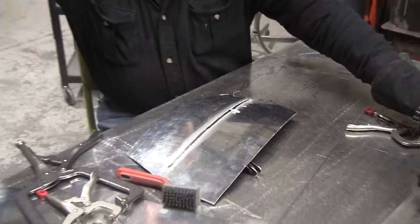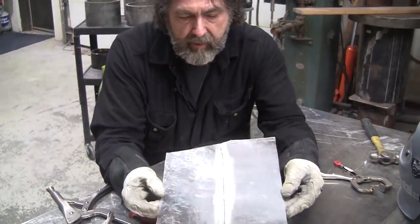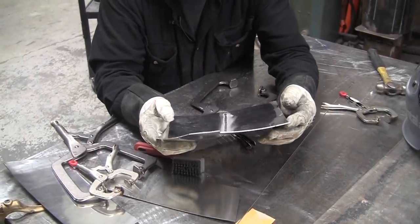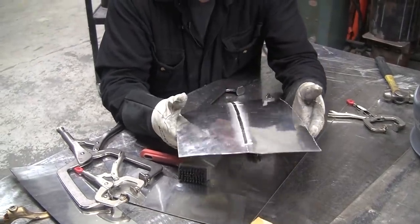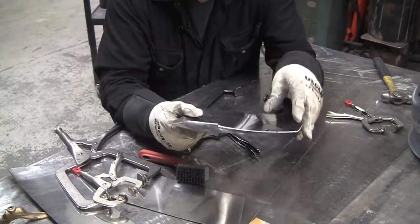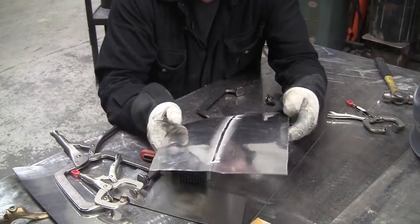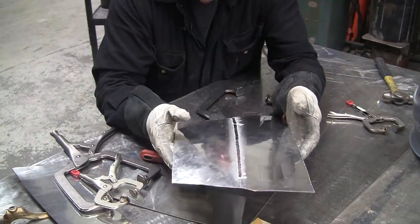There's the top side — no rod was added. We got a lot of drop-through on the back side. But if you look at the weld on the back side, the metal is shiny and clean — it is beautiful. I suspect I had probably a little bit too much amperage; it was a really hot weld. Hopefully we can put this in the planishing hammer and cold-forge that extra drop-through material up to the top, and then we won't have as many divots or problems. Then we'll do the torture test.